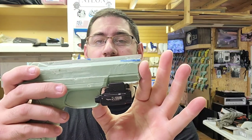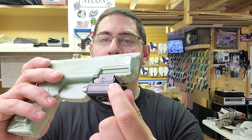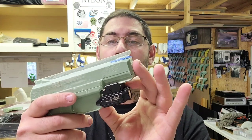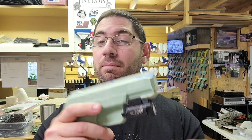One trick I know with the Olights — if you look on any of the Pale Horse molds or any molds that come with them, the blocking for it is actually further out. That way it pretty much eats that part of the body that comes out right there. On the mold, the body comes out just a little bit more, so there's none of that recess, because this right here could cause a little bit of hang-up in the holster if you're at the wrong angle. Mold makers will bump the light forward a little bit, so when you put it in the holster, your light actually sits back inside and it'll pretty much work perfectly.